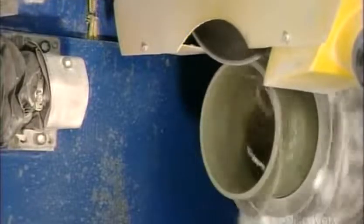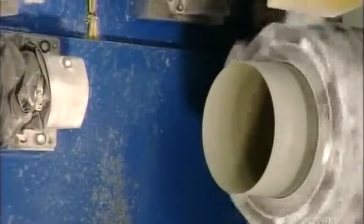Now they mount the top and bottom half cylinders on opposing lathes. A computer-guided grinding wheel with a fine diamond grit surface trims the edge of each half cylinder to an exact specification. Then it machines a precise 3-degree taper on each edge at opposing angles. An automated nozzle applies adhesive onto the tapered edges, then the lathes move toward each other, mating the halves. The tapered edges slot together in a tight fit.